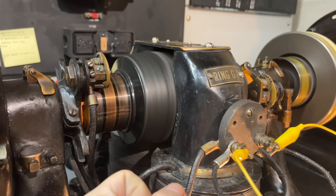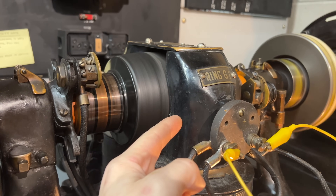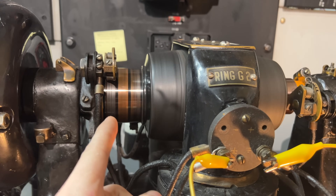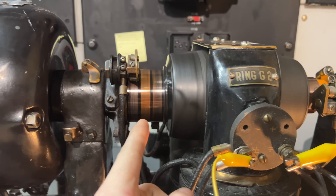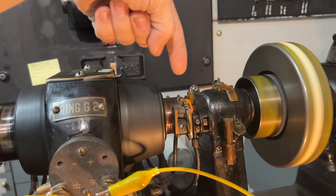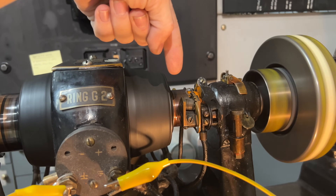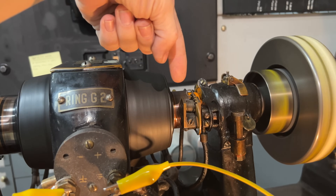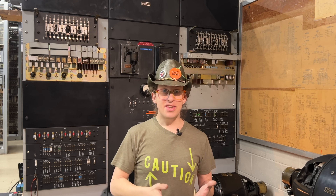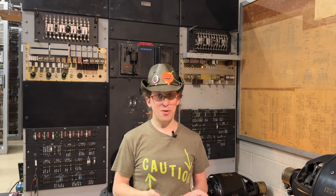You can also see these big chunks of steel, which carry the magnetic field from the coils right up next to the armature windings. Over here at this end are slip rings that pull the generated 20 Hz AC out of the armature windings, and down on this end is a commutator and brushes that pull DC out of the armature. That DC is fed right back into the field coils, and that's why they say this generator is self-excited.